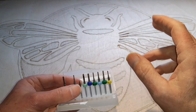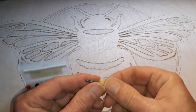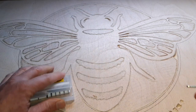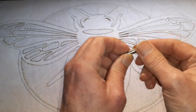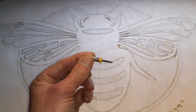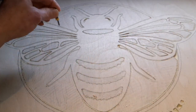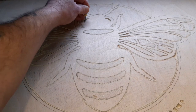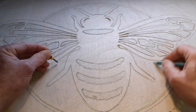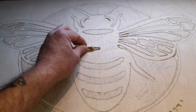If somebody's just starting out and doesn't want to waste a lot of money on fancy parts - I've picked one out that I know will fit into these areas. It's just a simple case of popping it into the adapter collet, pushing it down to that little barrier, setting it to the same depth of 3 millimeters, and then going along and basically removing all the penciled-out area. Okay, let's remove all the area now.